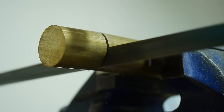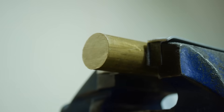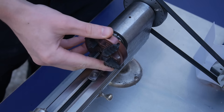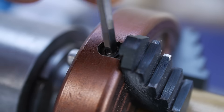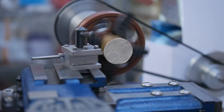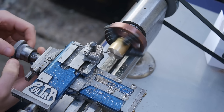Historically watchmakers used an arbor to which the blank could be glued using shellac. In the modern age we can use super glue instead, which is much more convenient. Like the gear itself, this arbor can also be machined on this little watchmakers lathe. I'm starting from a brass blank 25mm in diameter.